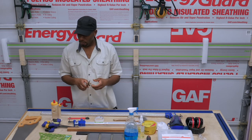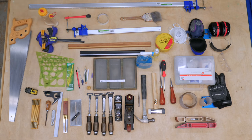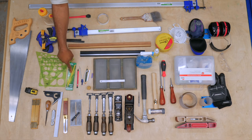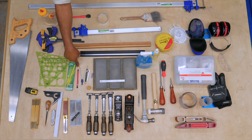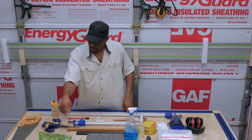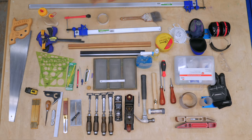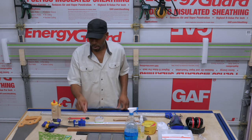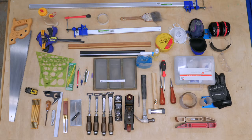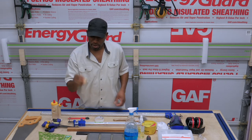If you go out to your local office depot, you can find circle and elliptical templates — they come in handy. For marking, I recommend number two and a half pencils, or a mechanical pencil number five or greater — I usually use a 9 or 7. Compass for making circles and curves. Chalk is excellent for marking and doesn't damage the board or leave a permanent mark — I use purple for lighter color woods and white for darker color woods. I use a dedicated eraser, because when you're working on wood surfaces, the eraser on your pencil goes quickly.